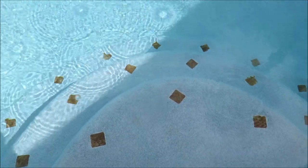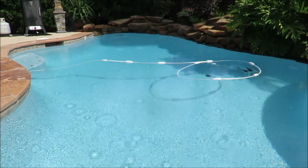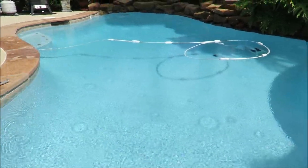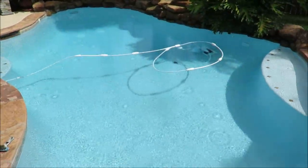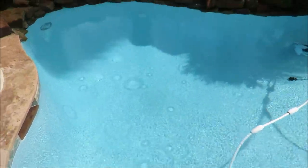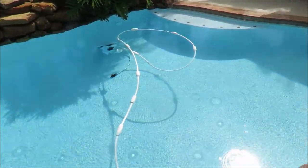I did the startup myself — it really wasn't that big a deal. You have to brush it; they recommend twice a day but I actually did it four or five times a day until the dust disappeared. I put in a couple of gallons of muriatic acid, and as you're sweeping, the muriatic acid dissolves that dust. It's been three weeks now, I've got my pool equipment up and running, the chemicals are perfectly balanced, and I think it turned out great.